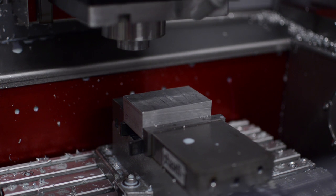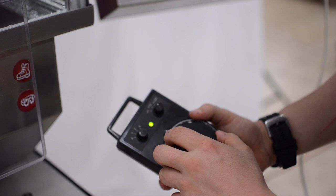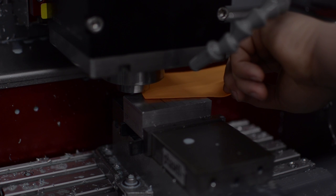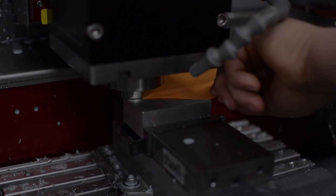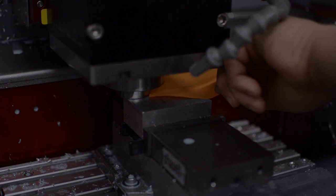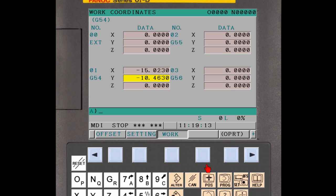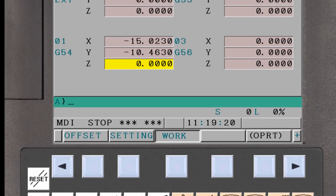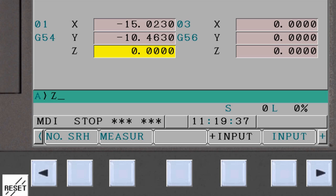With no tool in the spindle, jog the spindle nose so it is about an inch above the top surface of the part. Using the smallest jog increment, very slowly move the Z axis down until it is almost touching the part, leaving a gap of a little over a paper thickness. Take a thin piece of paper and test if it can be inserted between the spindle nose and the top surface. Move the Z axis down one increment at a time until there is a slight mechanical resistance between the paper and spindle nose. Press the Offset Function button on the CNC MDI panel. Press the Work soft key to display the workpiece coordinate system offset page and select the Z axis for the workpiece coordinate system setting used in the part program. The Z axis is now positioned a paper thickness above the part. This next step varies depending on the workpiece: if the top of the part is a good finished reference surface, all we need to do is allow for the thickness of the paper.